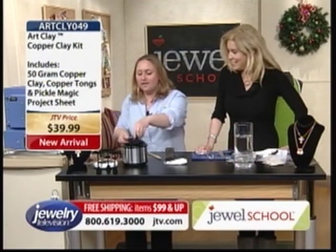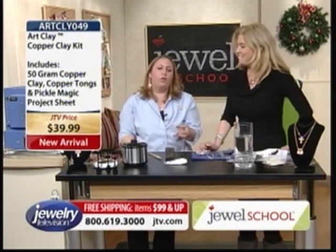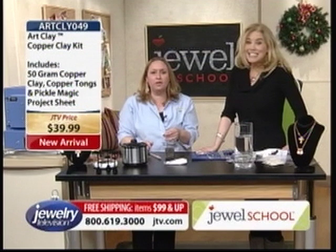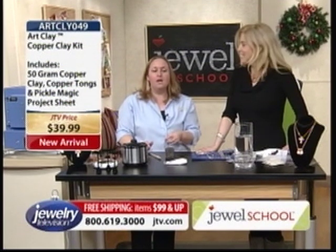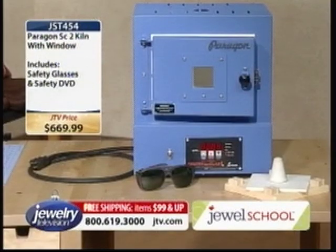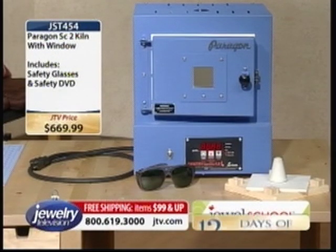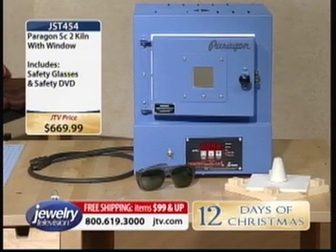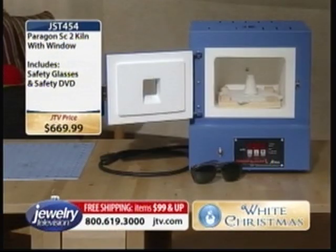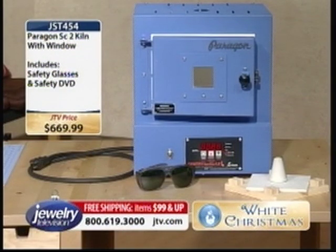Now, this pickle, like everything the Art Clay family offers you, is eco-friendly and non-toxic. The pickle we're using is nothing more than citric acid pickle. Picture amazingly strong lemon juice, times 100. Well, don't go drinking it. It's not lemonade. This is a super eco-friendly and non-toxic pickle. So when you're done with it, if you realize your piece is sitting in there a while and it's just not working as well as it used to, you can mix a little baking soda into it and pour it right down your drain. It won't hurt your plumbing. It won't hurt the environment. It won't hurt any of your facilities. It'll be completely fine. And so will your piece.